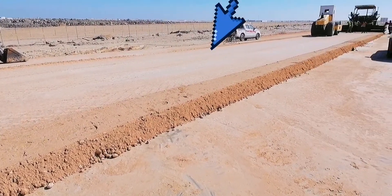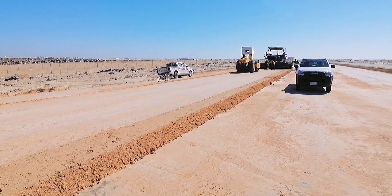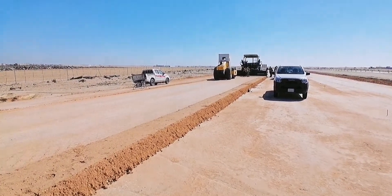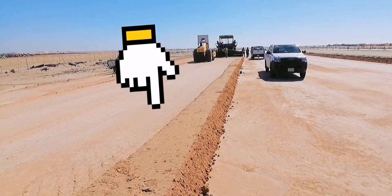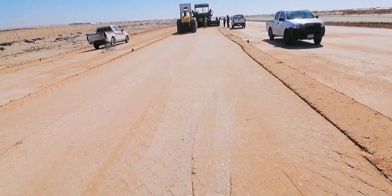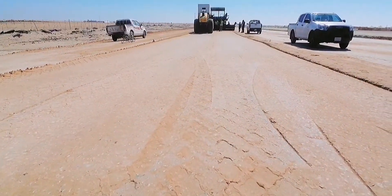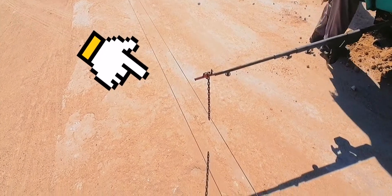The base course layer. Tandem roller starts to compact the laying, but the operator leaves half a meter each side — not to compact — for the preparation of laying the other lane, to get a good top plane surface. And this is the guide of the operator for the alignment of the paver.